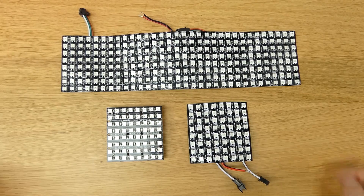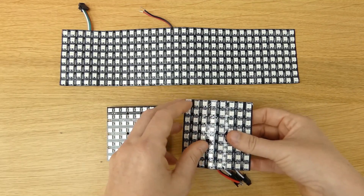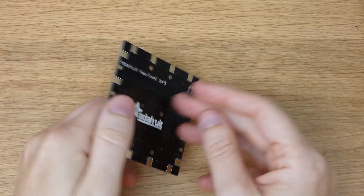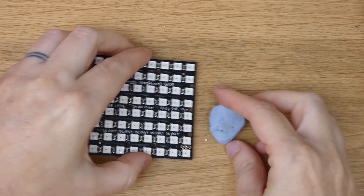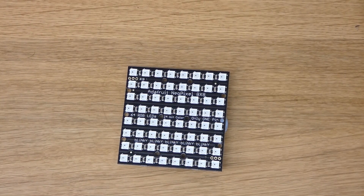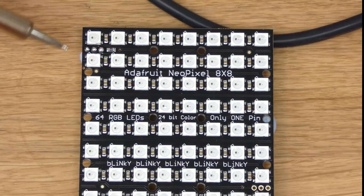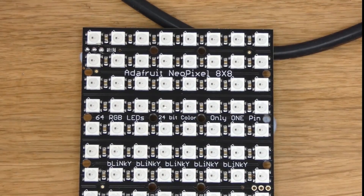Here are a few matrices you could use for this project — here's an 8x32 and an 8x8. These are both flexible grids, so I think they'll look really good inside the face mask, natural wrapped around the face. This is a solid 8x8 one from Adafruit. We need to solder the pins onto that. I'm just going to use some blue tack to keep everything steady. I've got the three pins soldered without them touching each other — I'm sure I melted that LED a little bit, but I think that's good.